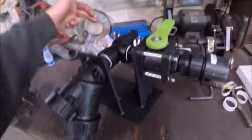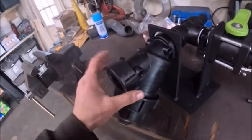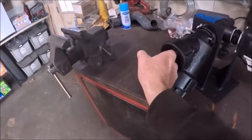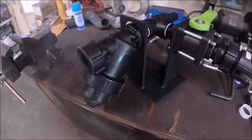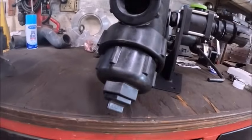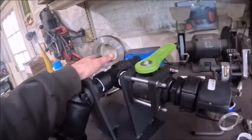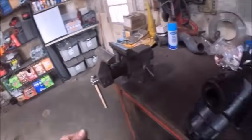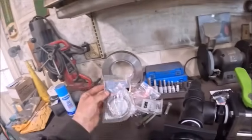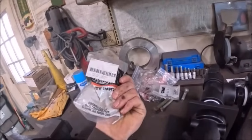Fill's going to be here, to tank and to toolbar. The reason I had to put the fill here is because you can't fill backwards through the strainer. Otherwise, your strainer baskets are going to catch stuff here and then it would end up washing right back to the toolbar, and that defeats the purpose of having a strainer basket. So I guess now I can go get the forklift warming up. We could bring the tank up here and start working on that, because we got to put this on, put the hitch on, and I got my axle seals or felts or whatever you want to call them.